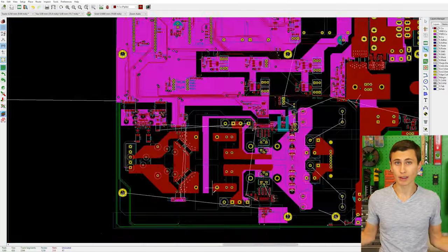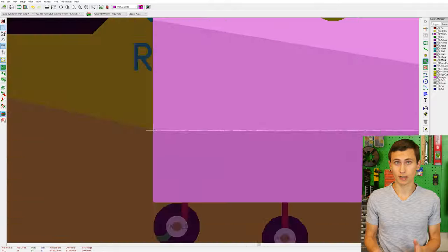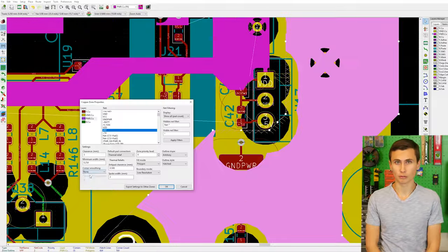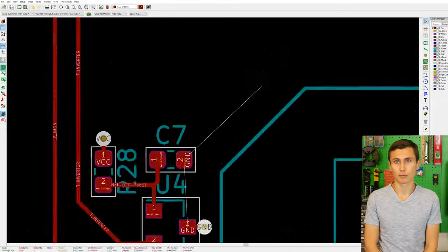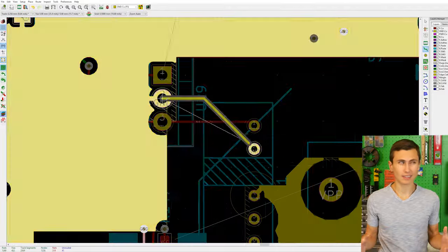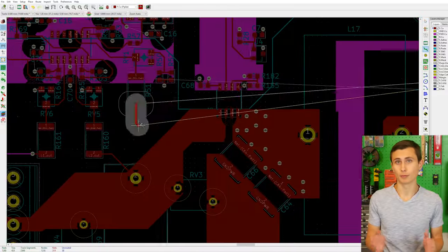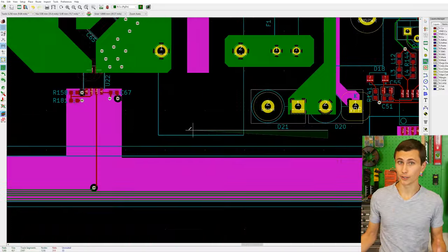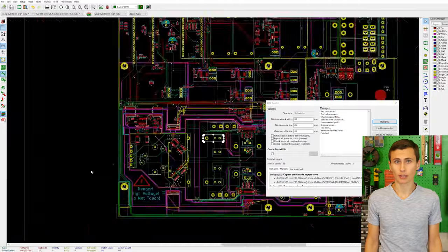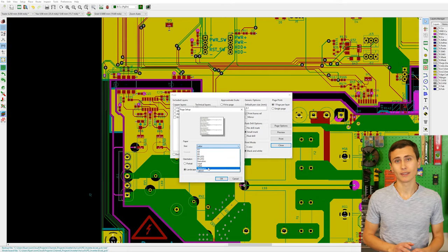The 5% resistors will probably be fine in all cases — in critical circuits I used tighter than 1% tolerance anyway, so those are unaffected. For general pull-ups and pull-downs where the 5% parts were primarily used, the resistor value has very little effect on performance. I can always swap out a few critical parts by hand if necessary, and that's why we used 0603 parts in the first place. I've found 0603 to be a good compromise between component size and hand solderability. At this point our schematic is complete, layout is finished, reviewed, optimized, component values verified, and footprints confirmed.